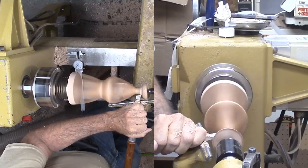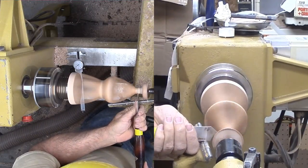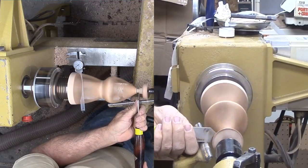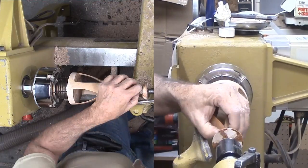I don't think the top will hold together to hang directly. On other ornaments, I've had small portions come apart. So I'm carefully reducing the top to a 3/8 inch tenon. Later, I'll turn a finial to cover it.